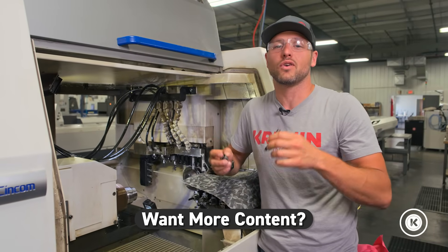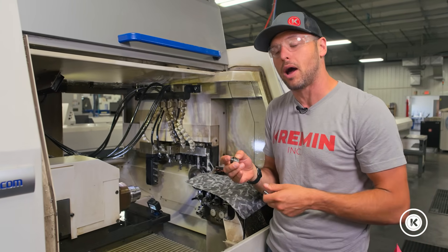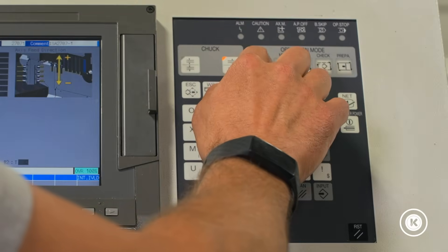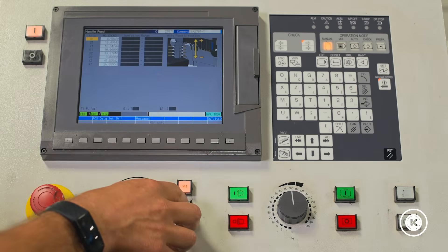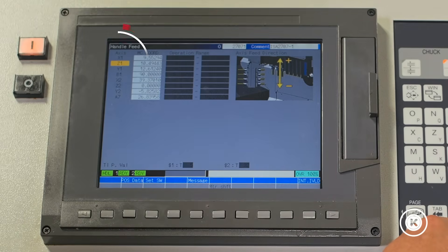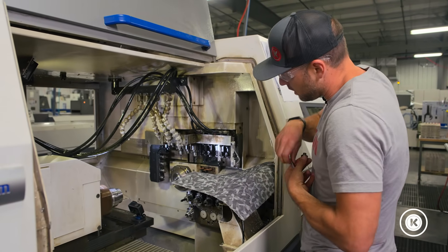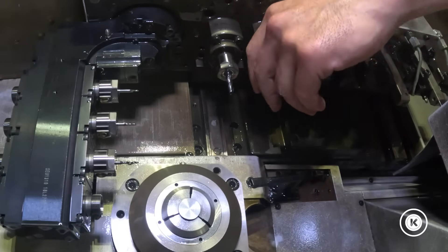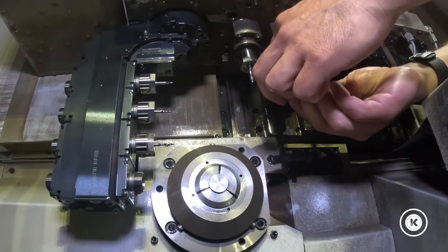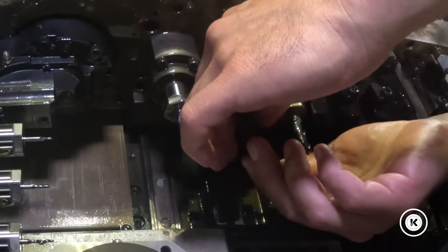The second tool Mike wants us to put in is a standard 3/8" end mill. Similar process to the turn tool, but a little different because it's a live tool. First, to make it easy on ourselves, we're going to bring the gang over to us. Go into manual mode, make sure the tool is all the way up using rapid movement, then move to the y-axis and bring the gang on over. This makes it easier to put the tool in — there are a lot of sharp tools in here and you don't want to slip and have an accident. An important part with end mills and any live tools: you need to know your set distance coming off of this. Some guys use rulers or a block to get it close. I've got it snugged up in there — it's not tight yet.